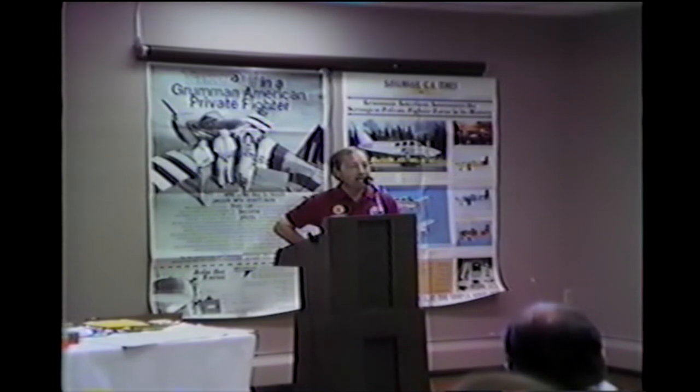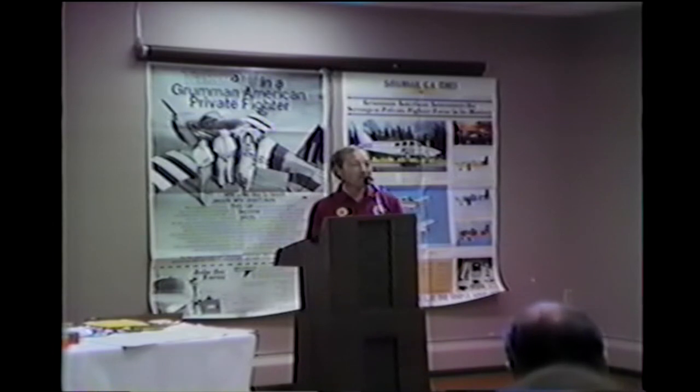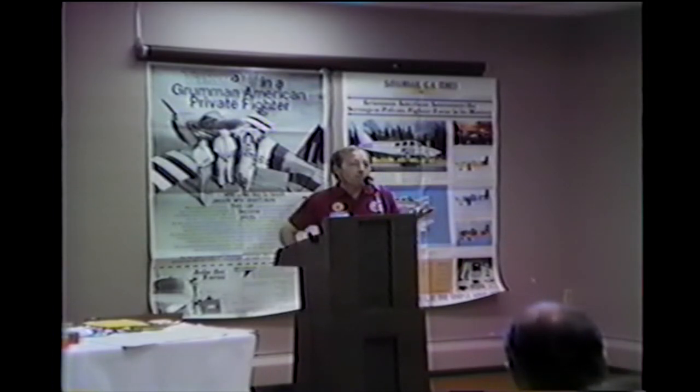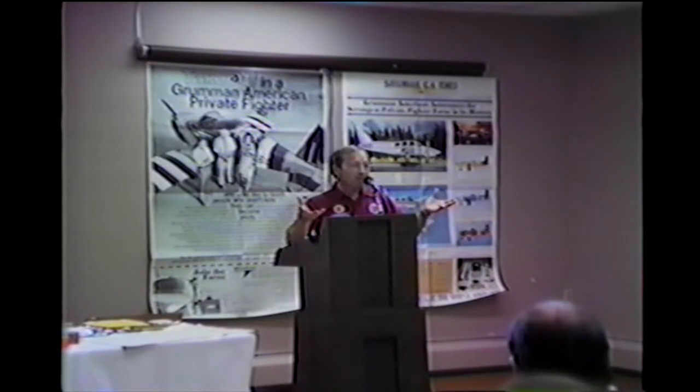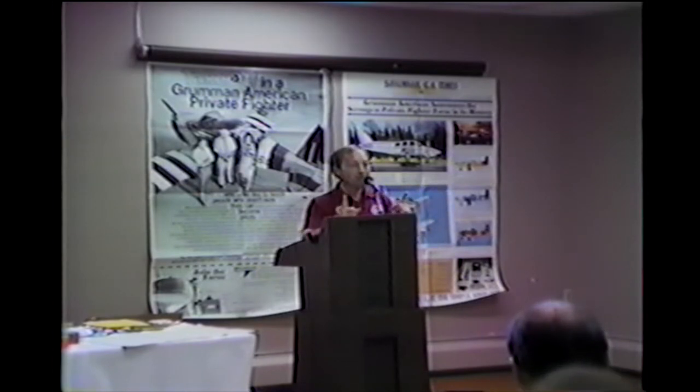And I got a bald head mechanic out there, his hair looked like you after he discovered a spar leak. If you've got a spar leak, definitely that sucker is pouring out at one end or the other, either outboard or inboard, around your spar in the center. It's going to make a big mess, and you can quickly identify it, and you'll probably have drooping rubber and all kinds of stuff on there. There is a couple other things. A fuel transmitter leak will cause that. You pray for a fuel transmitter leak, as they're easy.